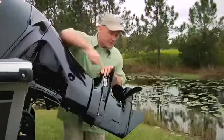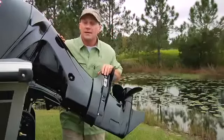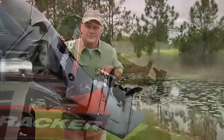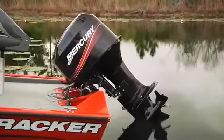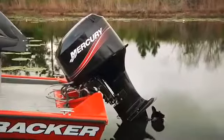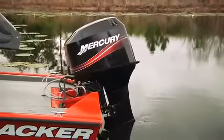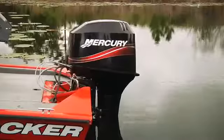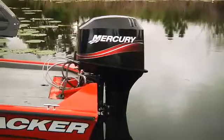Your engine is cooled by water being picked up through louvers in the lower unit, then pumped up into the power head and expelled through the exhaust system. That means the engine must be tilted down into the water for it to work — unless flushing the engine. Never attempt to start the engine unless it is tilted down into the water. Doing so can be dangerous if anyone is close to the propeller and can cause damage to vital cooling parts. Tilt the motor fully down, then you're ready to begin the starting procedure.